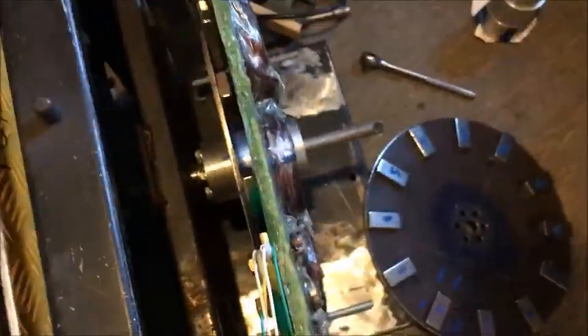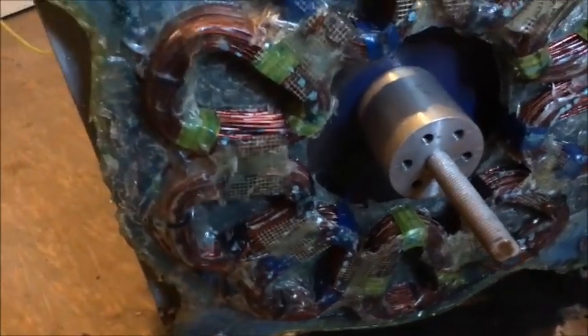The plate thickness needed for the magnet has to be, bare minimum, half of the magnet thickness to transfer the flux. Overall performance isn't too bad. This was an old welding frame which I stripped down — the copper came out of it. The scrap man only wanted about two dollars a kilo for the wire and it was perfectly good. I unwound it and wound these coils — they're 90 turns each — and the enamel was in perfect condition when I was pulling it apart.